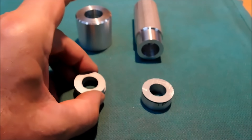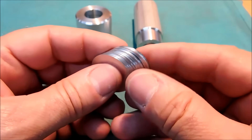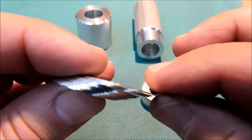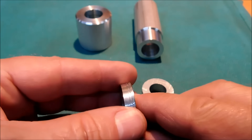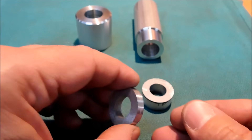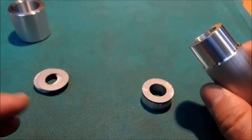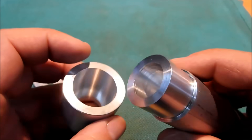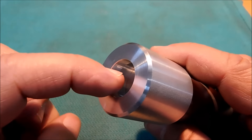These are the parts we have to bore out. It's a 0.625 ID, about an inch and an eighth OD, and there's a bunch of parts here. It's real thin material. In with the mix, there are some tin foil parts that are just over a thousandth of an inch thick. What we're going to do is pressure turn them on an arbor - sit them inside this cup, put the arbor together, put a lot of pressure on there, and bore it right through the center.